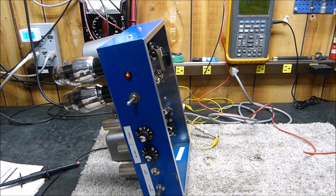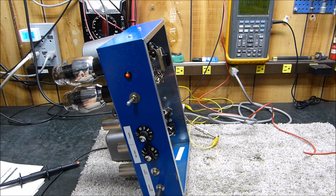Before, what I've been running is a high-end studio type mic into a Behringer preamp. And then that drives a real nice little high-end mono amp I built with the BO13 transformer. It does a beautiful job from 20 to 20 kilohertz at low distortion, and it's a grade 1 class A type hi-fi amp. And then that's what drives the modulator. And people say it sounds fabulous.